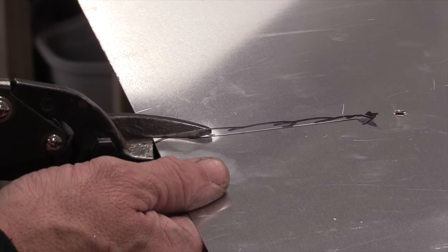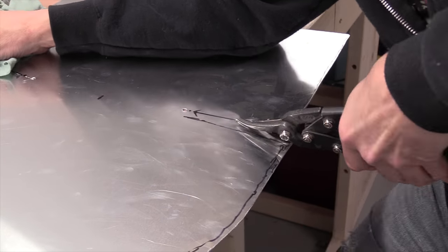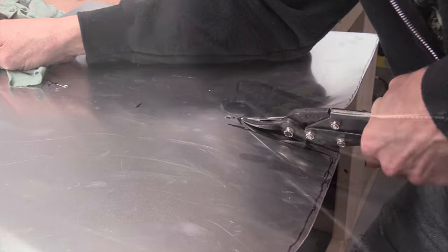Another little sheet metal trick for you if it helps. If you're going to cut a slit in something that's then going to be folded, drill a hole in the end of the slit, stop it running further than you want.